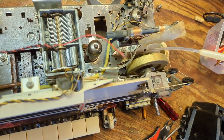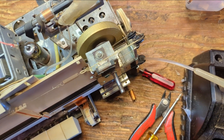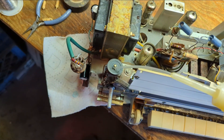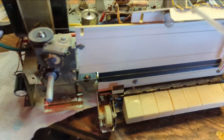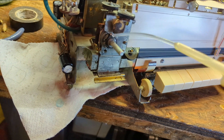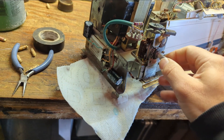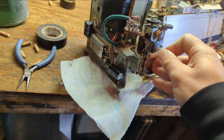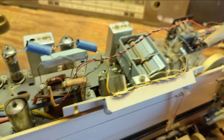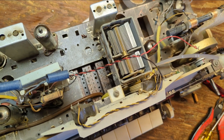I removed the knobs and the front plexiglass and was able to tighten up the volume knob with the nut. Since I have this all open, I can clean all the dust bunnies off the back, clean the glass, and lubricate all of the little pulleys attached to the tuning mechanism. There's also a push-pull switch in here that activates a ferrite rod antenna. Now I'm going to oil everything so it moves a lot nicer — just a little bit of Zoom Spout oil here and there.